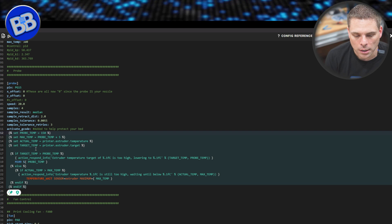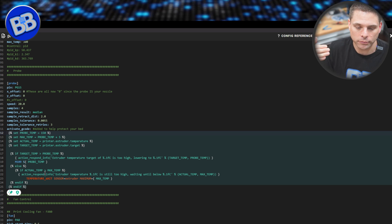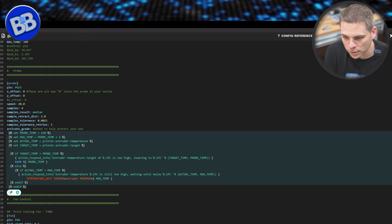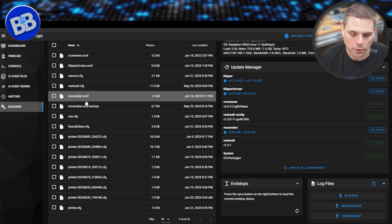We went and put in this variable setting that says: if the nozzle is hotter than 150 degrees — or whatever amount we put in there, 150 being the one that was blessed by the Voron team — then hold on, slow down, cool down that tip, do your probing, and then move forward. But printers are only as smart as the information they have — they're just like computers. What happens is your printer heats up to 210 degrees or whatever, comes back down to 150, does a G28 on XY and possibly Z, does quad gantry leveling, and then gets ready to print and says: I can't extrude plastic at 150 — I don't know what to do. So it just sits there.